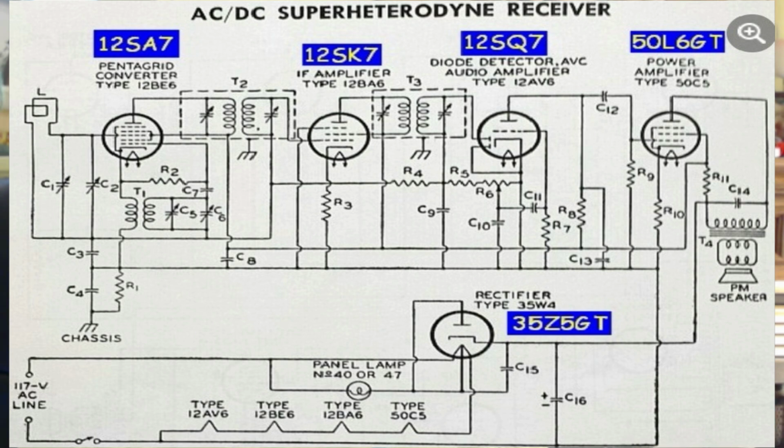some of them 465, and some of them at 456. I do not know why those three were chosen, but they were. Some of the earlier superheterodynes, and not in this class, used 171 kilohertz. Again, it's heterodyning, where when you mix two frequencies, you get out of that circuit the sum, the difference, and the two frequencies. Now, when you come out of that circuit, you come into a tuned circuit, and that tuned circuit is tuned at the IF frequency.